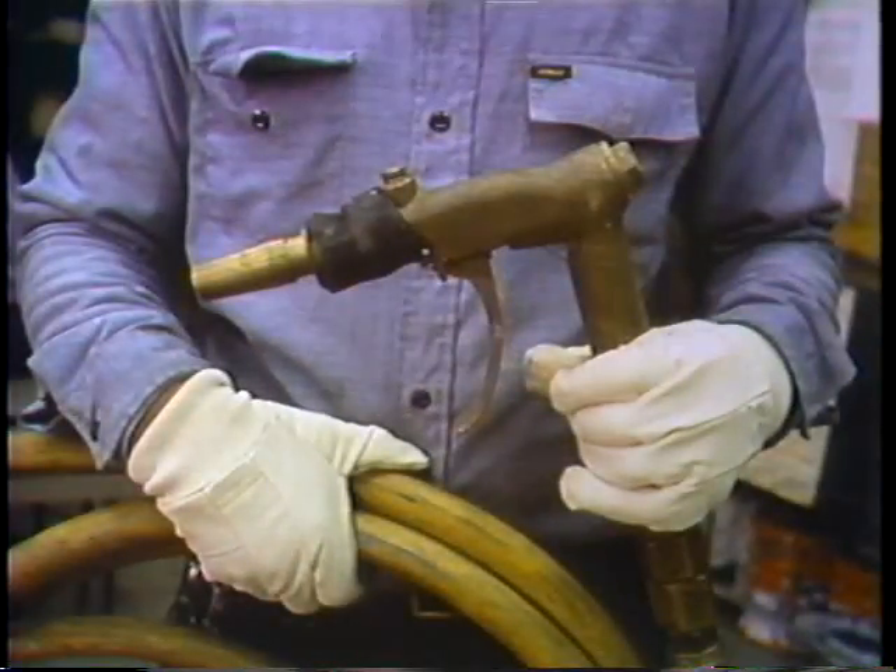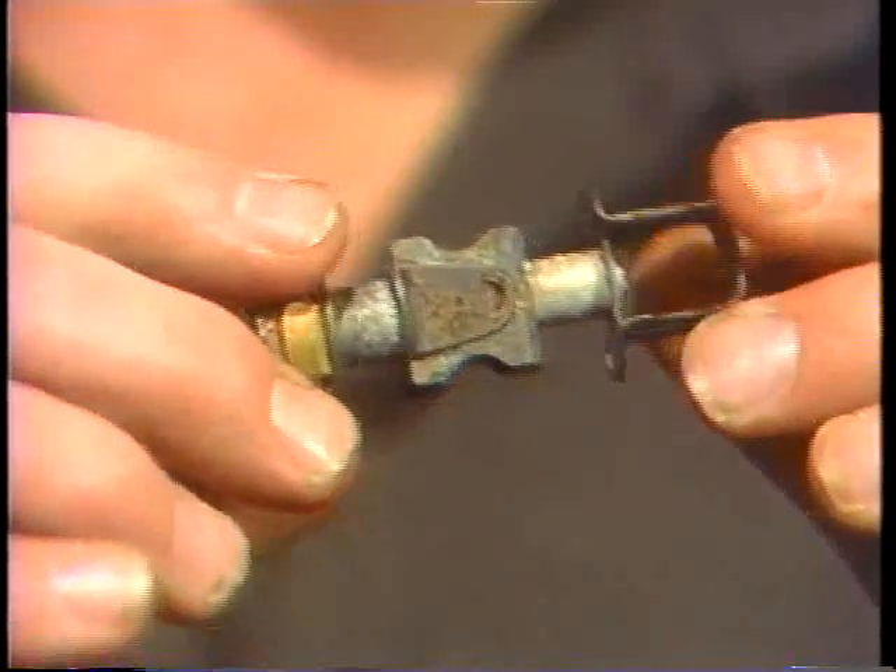If there's only mud or silt accumulated inside the tubes, he may just use a stream of water from the gun. Sometimes the gun has a fitting that allows pumping in compressed air to turn stubborn accumulation off the walls of the tubes. A second method is rubber squeegees that just fit inside the tubes, forced through by the stream of water — these remove slime or soft deposits better than water alone. The third option is a tight-fitting wire brush with rubber plugs at both ends; the plug clears soft deposits while the brush removes harder scale.